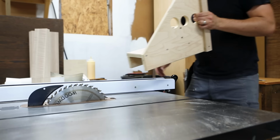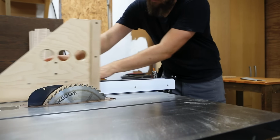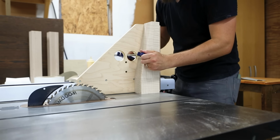But you can counter that by slowing down and taking your time, especially to make jigs like this high fence jig that lets me safely guide these parts through on end, knowing the blade is going to stay 90 degrees and on my layout line.